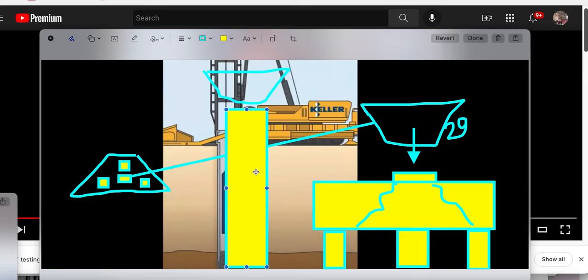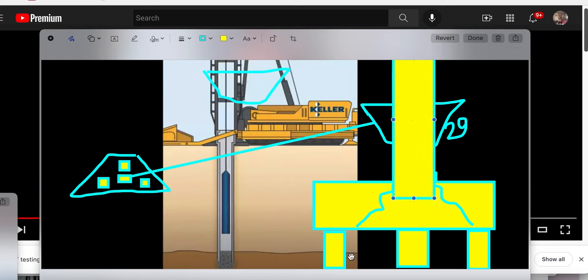And they came out there, and — boom, boom, boom — the column testing, they drove it down to see if it was really taking 50 tons. Let's say it takes 50 tons — they said okay, it does 50 tons. Well, what matters? I don't care if it fell at 40 tons. What really matters is what was the true load on it at the time of collapse. And that pool deck was not putting 40 or 50 tons on this. I'm having a little Columbo move on you — this is the column, and there are piers down below in the ground — one, two, and three — right about where they were doing, I think it's a three-pier setup.